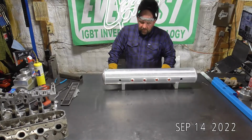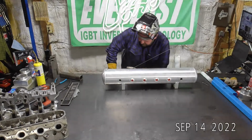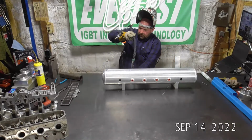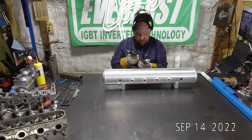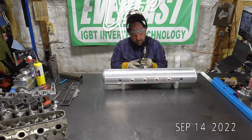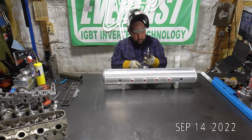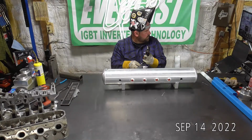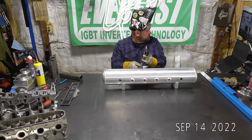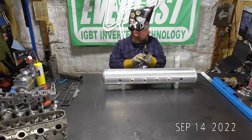But I'm telling you, I have saved $800 worth of time just on sharpening tungsten. That thing is amazing, and it's consistent. That's the main thing, is it's consistent. You can get the same grind, the same angle every time. And so you're not always fighting a different setup. Consistent results require a consistent setup. And like I said, that Turbo Sharp definitely helps you have a consistent setup.